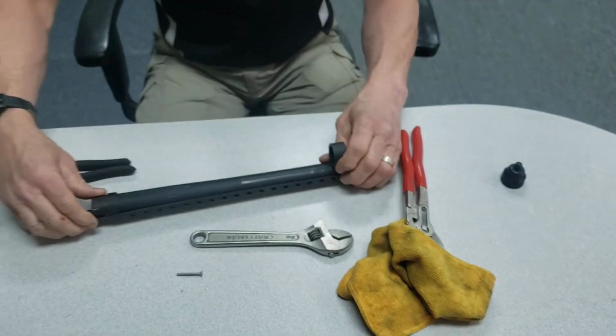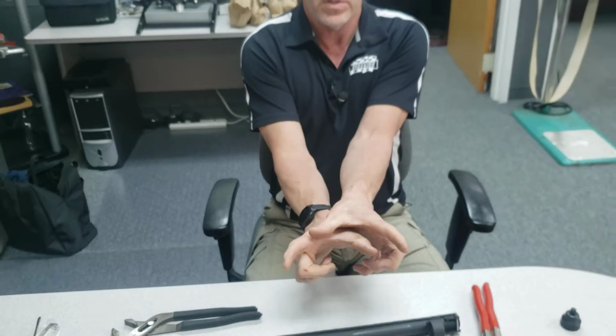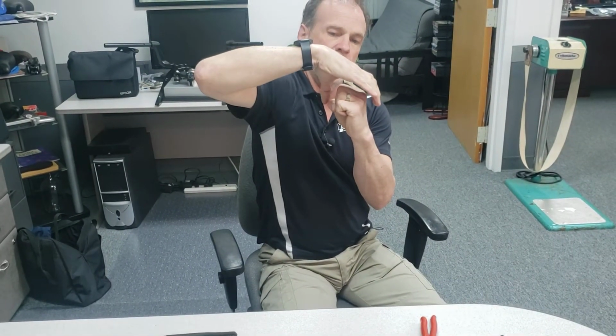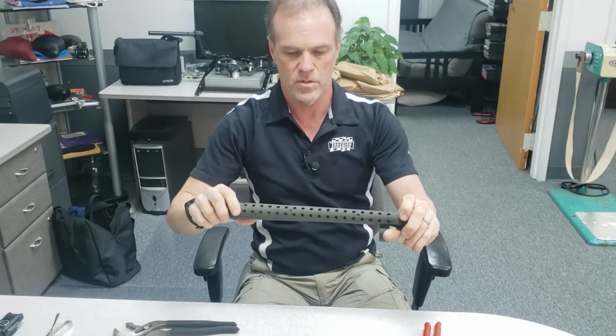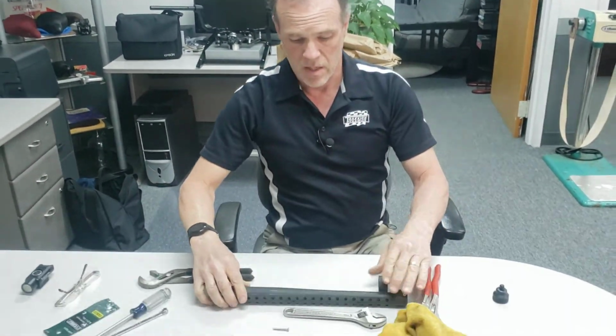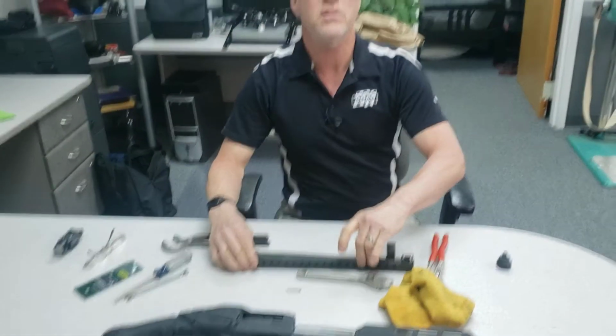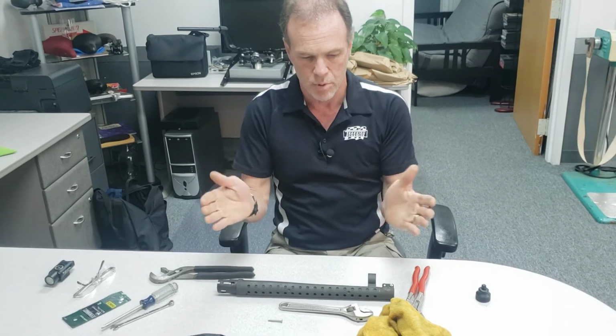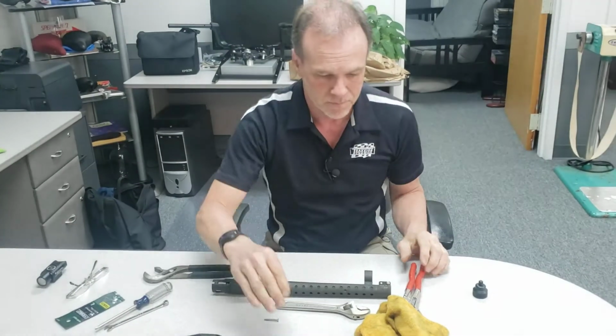It's actually flared from the factory in almost a wide pattern around the barrel. You're just trying to form it to the barrel more so that it's more rounded in nature. All right, and don't go too far because this is easy to do, and just come back and keep adding a little more if you need. So just bring it in to where it's kind of rounded some.